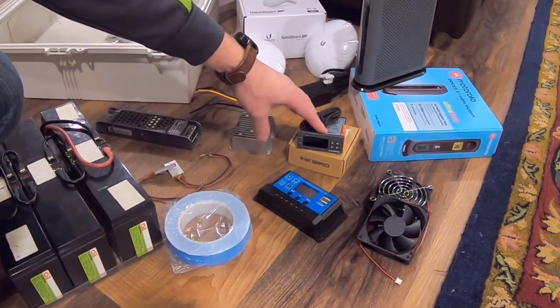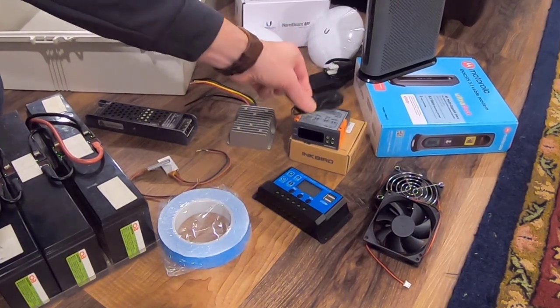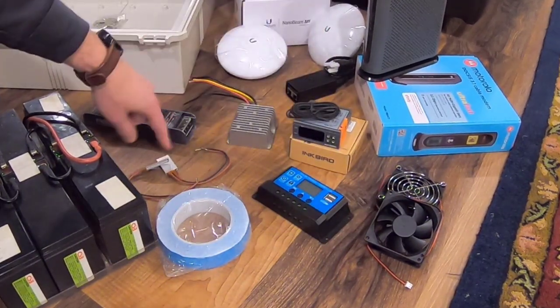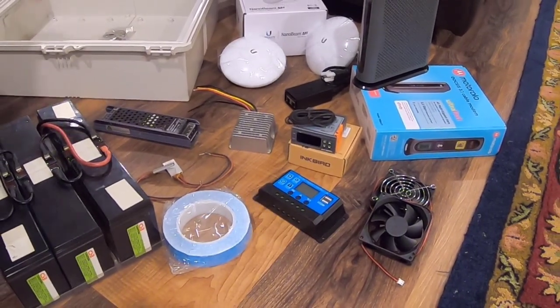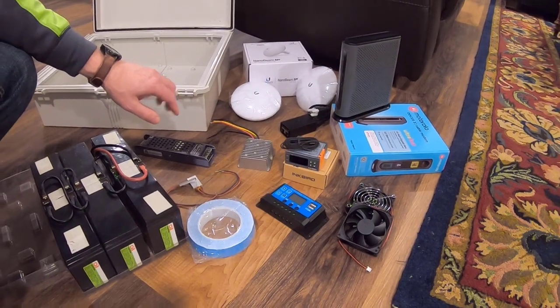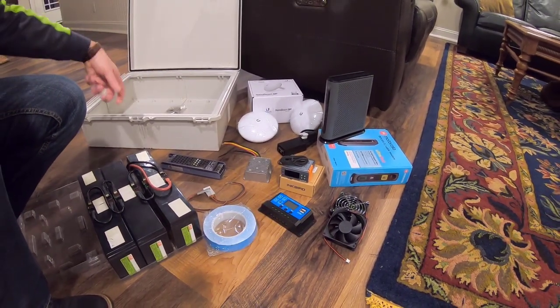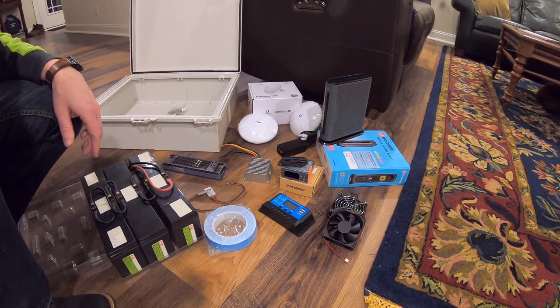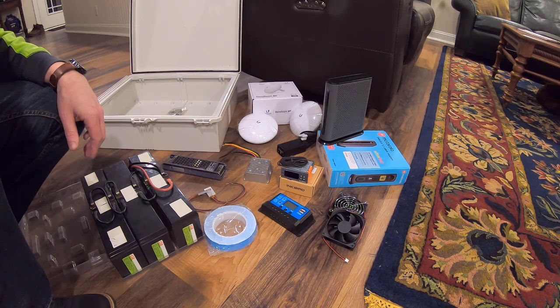And this little guy who runs on 12 volt is responsible. He's got a little temperature sensor on it, which will go on the modem. Heaters will go on the modem. The fans will go on, one on the bottom of the box, one on the top, on the inside, one pulling air in, one pushing out, so we can get very efficient air movement through the box to keep it cool. Then let's see, what else do we have?